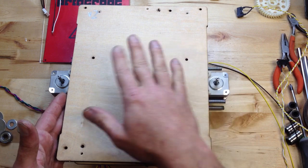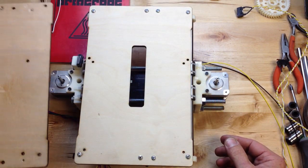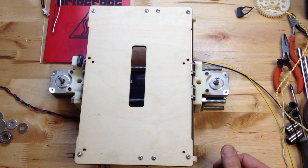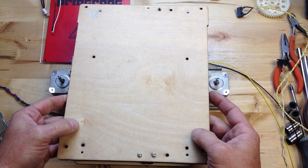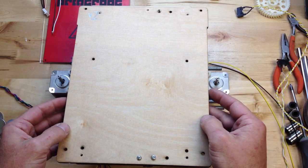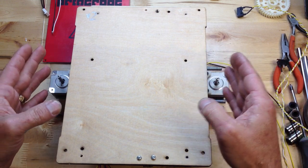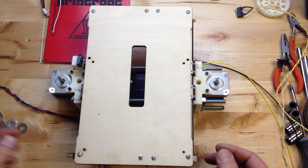First things first, we left off and we had the bed mounted with the heated board on top. The first thing we've done — you can see here I've got a smaller board. This is an old version, and you can see how wide it is. We have trimmed it down a little bit. This was actually the original design — the PrinterBot was a little smaller to accommodate the 6-inch beds. But for the bot farm here, we didn't have the 6x6 beds made yet, so we put the 8x8 beds on and had to make this a little wider. Now we have the 6x6 beds, and the wider doesn't really work that well because it's really tight with the 10-inch rods, and it doesn't even reach the sides. So the intended board that was always supposed to be on the PrinterBot is this smaller one.